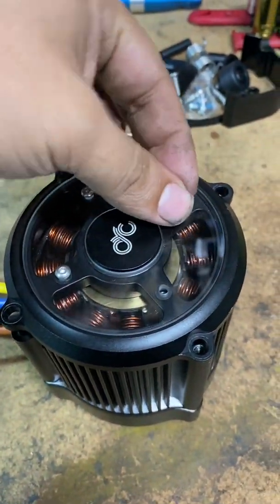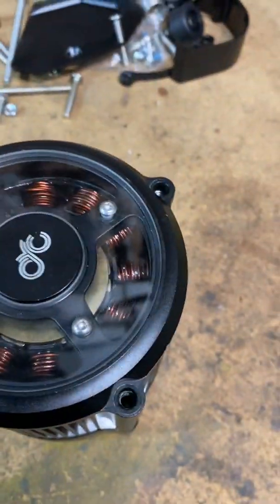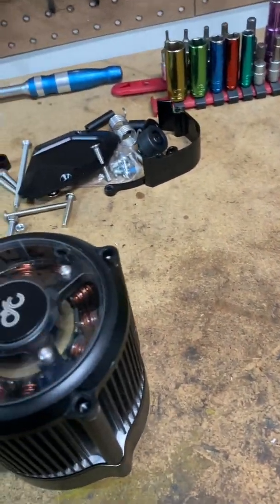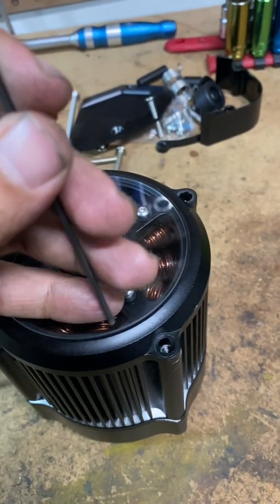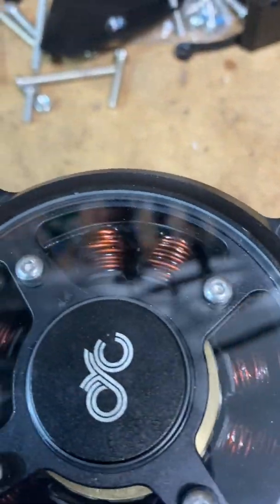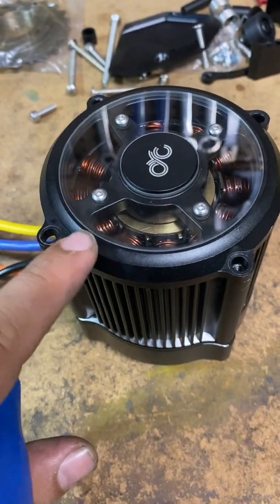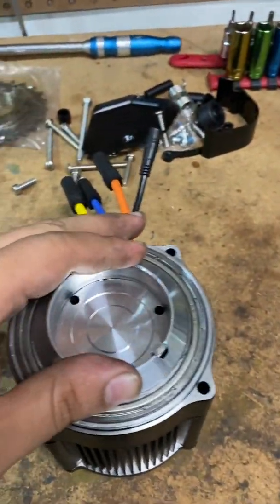That's this bracket — this motor is really, really powerful. For people riding this motor on 72 volts, especially on a bike with only one gear, that's a lot of torque for this little motor. Regardless of what controller or battery you're using, the tolerances for the motor itself cannot tolerate such torque. My guess is that the stator rocks inside of the case, which is what causes it to rub and then potentially break. I don't know if it's to do with the high RPMs more than it has to do with the alignment itself when it's under load — I assume there must be some flex to it.